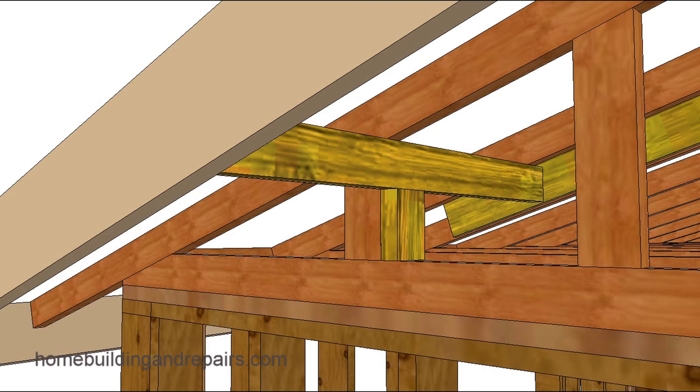Remember, these are examples that might work — they might not always work for your particular situation, especially if the roof overhang is longer than 18 inches. You could run into a problem using any one of these methods depending upon the roof. If you have a tile roof or something heavy, it might require thicker structural components than a two-by-four or three-by-four, especially with a larger overhang and heavier roofing materials.